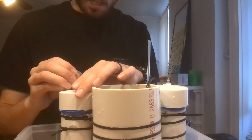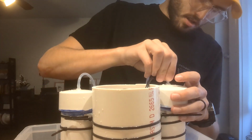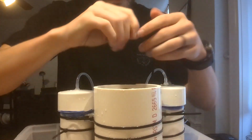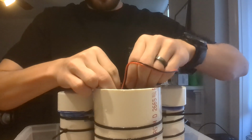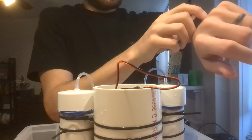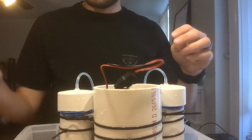Okay, I am reattaching my ballast tanks here. Attach my programming cable. I can reconnect my power cable. I then start a 3-minute timer on my watch. So reset. And in here, I'm gonna reset the Arduino, start the timer.